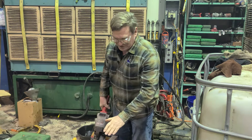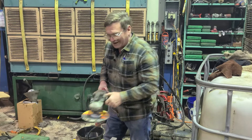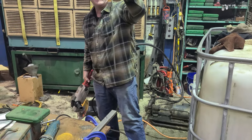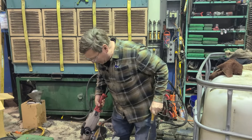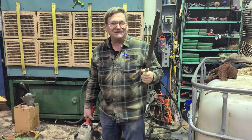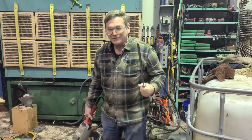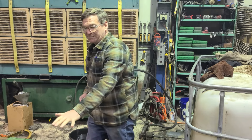If we're going to do this according to pounds of metal removed, the grinder is the winner. If I'm looking to remove metal by poundage, get a nine-inch grinder, get a good wheel — Cubitron or one of the others — something that bites in and makes marks. Don't mess with these toys. These are not for welders, not for garbage work. These are approaching the level of what you do with scraping.